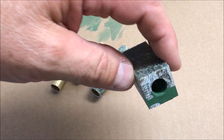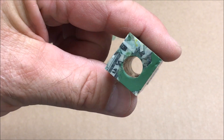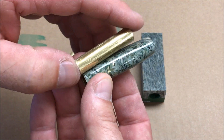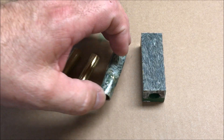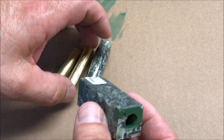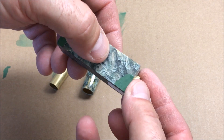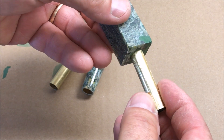I let my blank set overnight and the paint is good and dry. I don't know how well you can see into the tube but it's solid green all the way down through there. My buddy at club came through with the tubes — they're 27/64 inch in diameter but they were a tiny bit shorter, so I asked if I could have two and he was kind enough to give me two. I'll be able to piece those together to make this blank work. Now before I glue this up I want to put the tube in, but you can see the tube goes in this far and stops — I've probably got a little paint run in there and it won't go in this end.